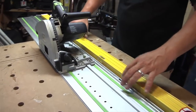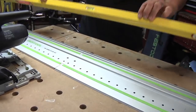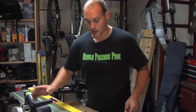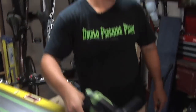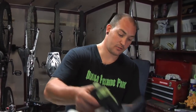Just remember to check it every once in a while with your six foot level, because when you move it, they can go out and get a little belly in it. So just make sure every couple of cuts, when you're throwing a rail around, you're checking it with your six foot level, making sure it is nice and straight. That is key and you should have no problems with it. So that's how I set it up — join two rails together and you're ready to use it with the track saw.